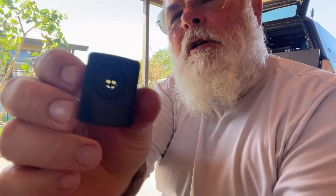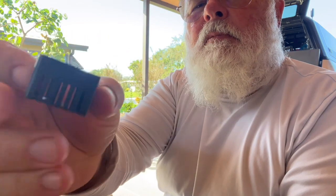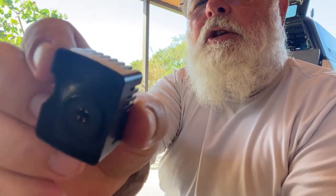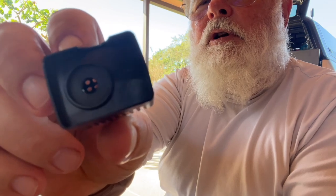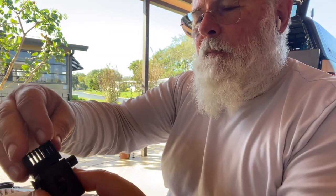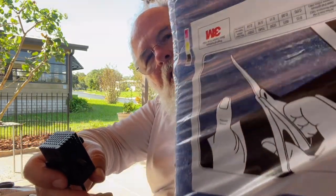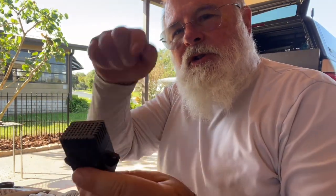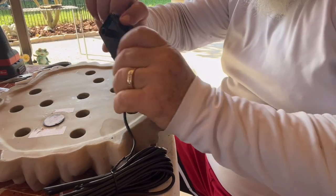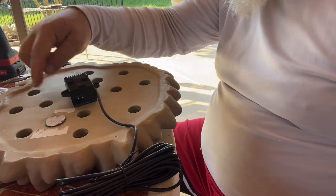One of the things I've learned about small pumps — pumps in general — the intake on this thing has a basket that a little tiny filter goes in, and then there's about an eighth-inch hole, maybe a quarter inch, that goes into the impeller. That's a tiny hole. So I'm going to use some air filter material cut to size to make a bigger filter. I want to increase the surface area of water going into the pump. I'm going to silicone this down to the plate, water will come in here, and I'll just wrap that blue filter around here to increase my surface area.